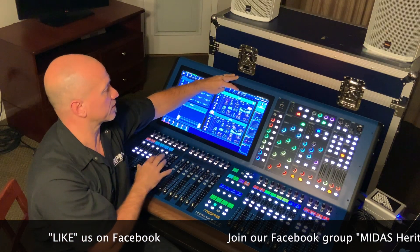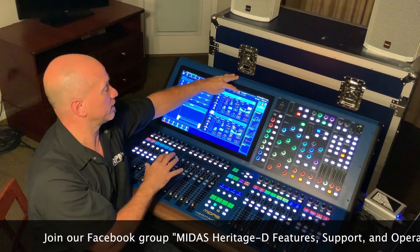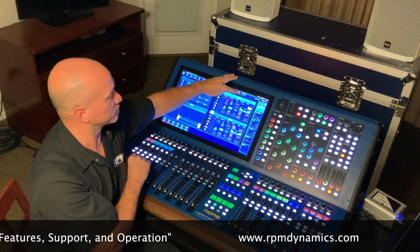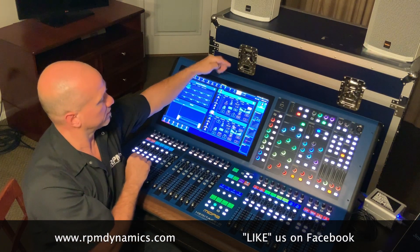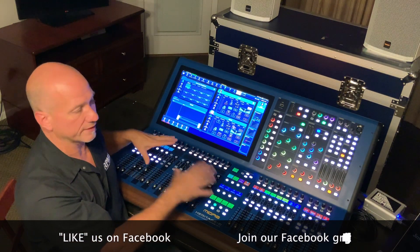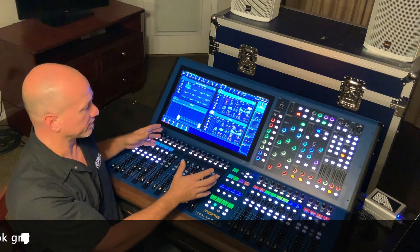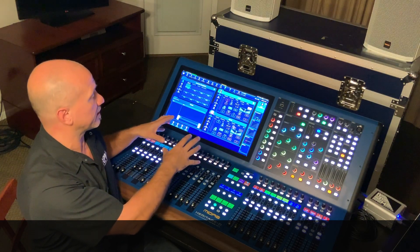To go into virtual sound check mode it's really just a little longer. All you have to do if it's a destructive thing is hold your finger on the button a little longer and watch the ring. So we're going to click this virtual sound check button, and when we push it we're going to see a little block go around it. It's going to highlight — this console is now in virtual sound check mode, ready to play off that computer. To go back to your regular mode, hold your finger down and out — we're back into regular mode. It's that simple.